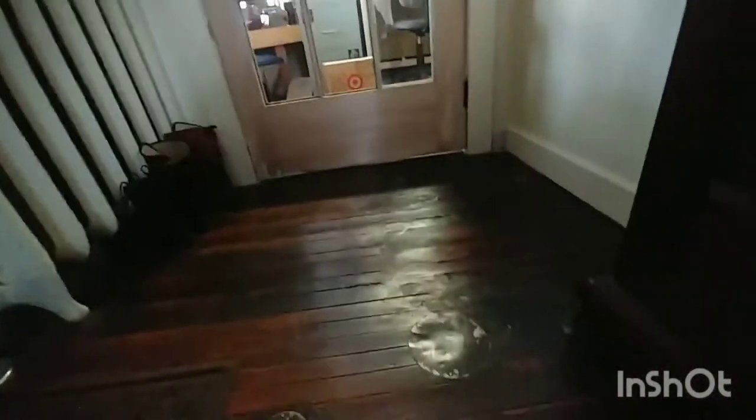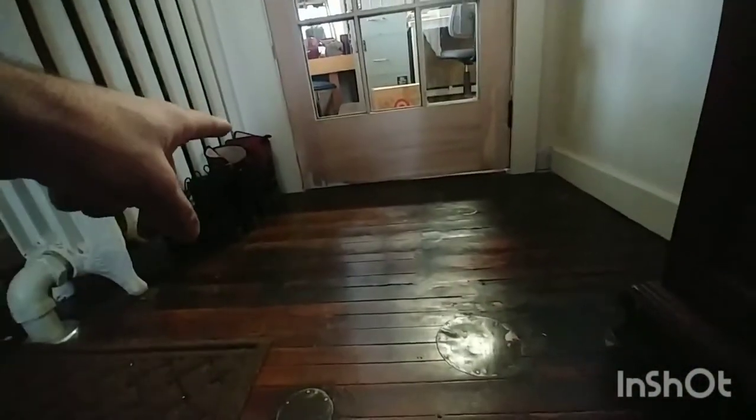But the gap under the door changes from brushing on the floor over here, leaving a bit of a mark, which you probably can't see. There it is there. You know, to there being a gap on this side. Anyway, I needed to figure out what was high enough to clear over here, and I guess I was a little bit shy. I'll take a tiny hair's breadth off the bottom corner of the door